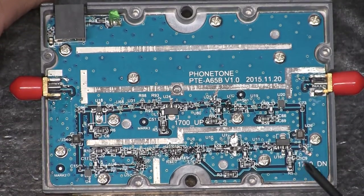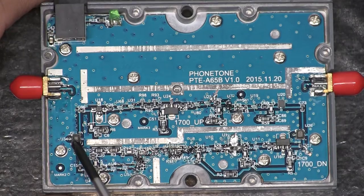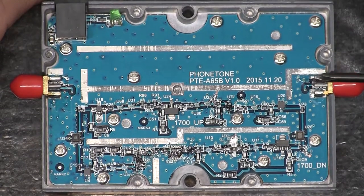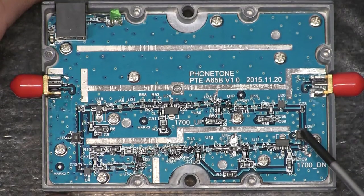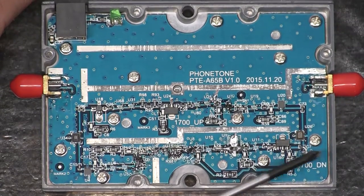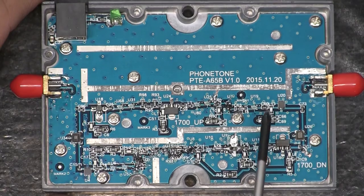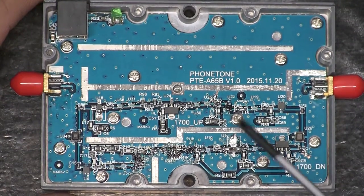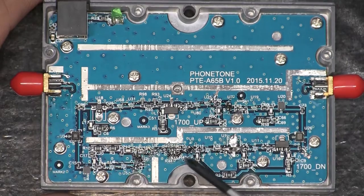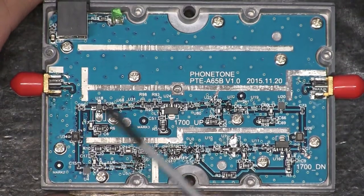So what do we got? Taking a look at this — this guy here and this guy here are what are known as circulators. What they do is they split power going in different directions. So if you've got signal coming in through here from the indoor antenna, it's going to hit the circulator and it can only go down one of these paths — it won't go down the other. Vice versa, if you've got signal coming towards the indoor antenna, it's going to go only towards the output port and not feed back into the other side of the circuitry. Same over here where power coming out of the amplifier stage for the uplink will only feed to the outdoor port and not feed back into the downlink circuitry. It only circulates in one direction between the three different ports.